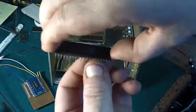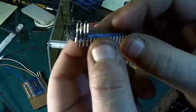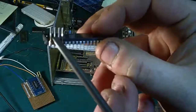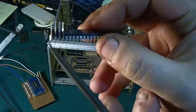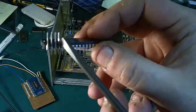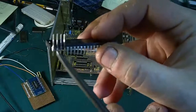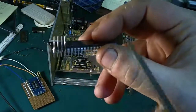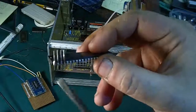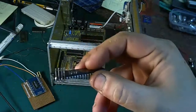Basically we've got the Z80 CPU here and all I've done is soldered onto A11, A12, A13, and A14 — four pins. I've soldered A14 on as well, and I'll probably have to solder onto the M1 line too, because to take this up to 32K we'll need A14 and the M1 line. But for now I'm using A11, A12, and A13, which is pin 1, 2, and 3 on the Z80 CPU.